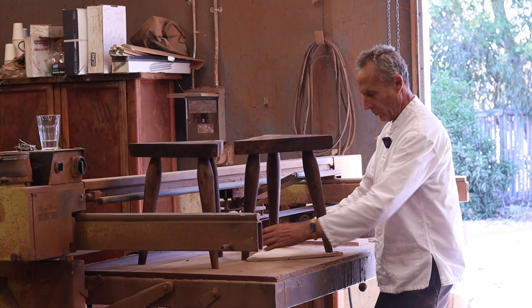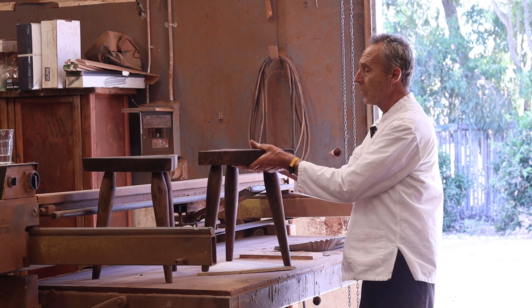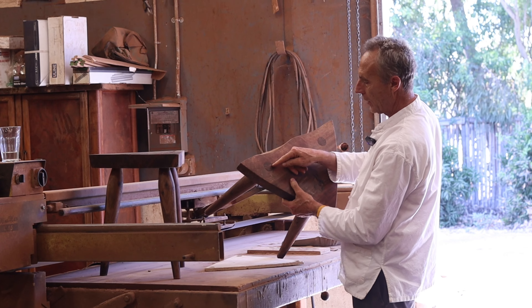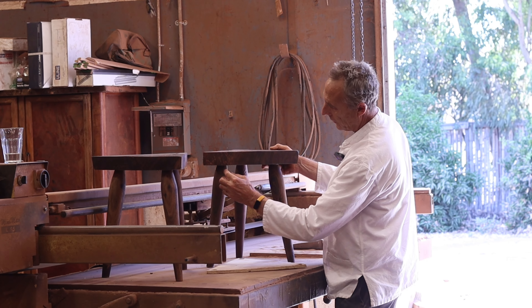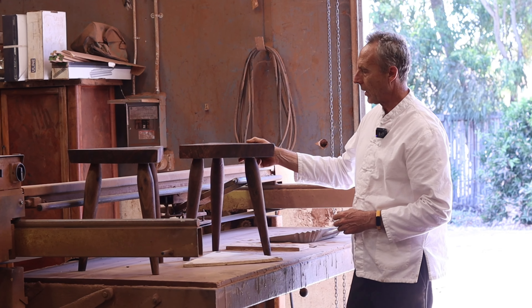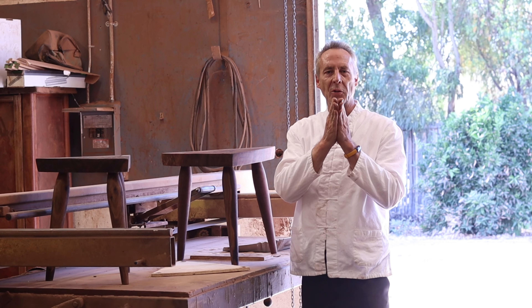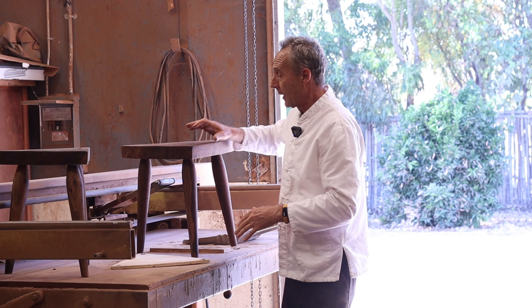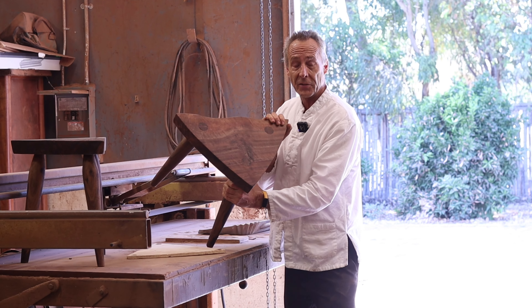What that allows me to do is position the legs inside the parameters of the target. And if you don't have a target, you're really missing out — you have to have a target. It has to be some semblance of where those legs are going to go, so if you're making multiple items, they look the same. I sliced the top of the leg with the bandsaw, running it the whole length of the tenon. When I put these wedges in there, it's going to push that out and fill that circle even better. It can help make up for discrepancies on the top side, and now you've got a full measure around that hole.